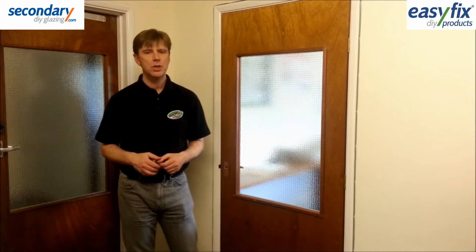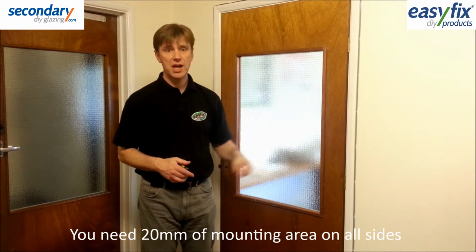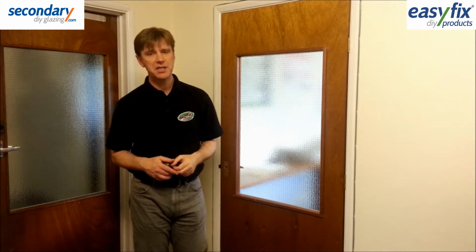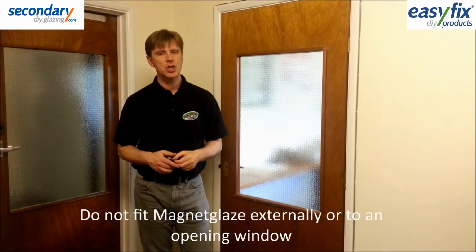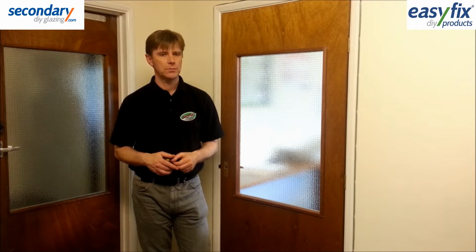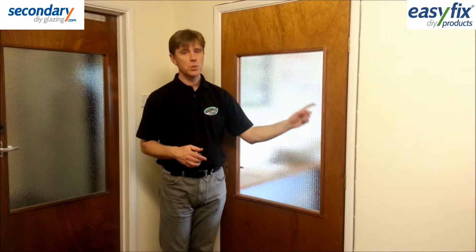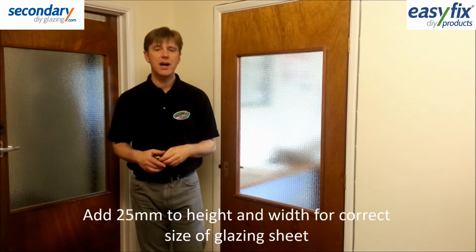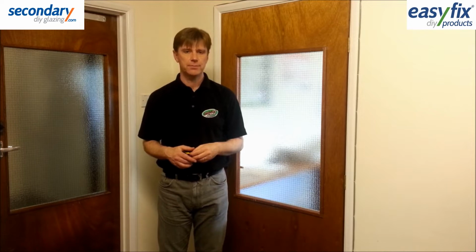Firstly, make sure you have about 20mm of mounting area on all sides of the window, as your fitted glazing panel will overlap. Bear in mind that Magnetglaze should not be fitted externally or to the opening part of any window. Measure the height and the width of the recess window, adding 25mm to both of these to get the right size of glazing sheet.